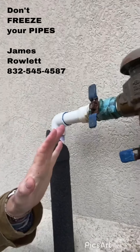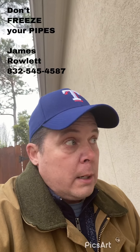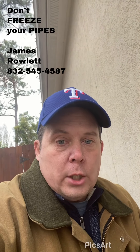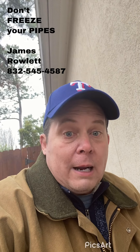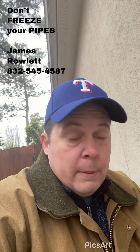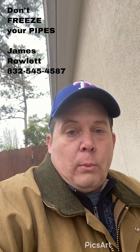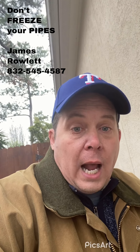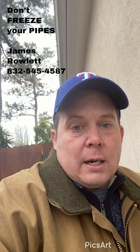It shouldn't have any water just because of head pressure. After you do that, take your handy dandy towel and cover everything back up, because it's the wind chill - it's convection cooling. You do get thermal heating back from the ground to actually help keep this warm, but it's the convection - air blowing across the pipes - that's going to take the temperature down. That's why you have the wind chill factor. So covering it blocks that, and now you're just working on conduction temperatures, so it should not freeze inside that pipe.